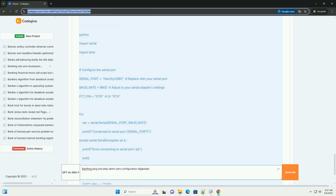8. Configure Direwolf: create or edit the direwolf.conf file, usually located in /home/pi, to configure Direwolf. Here's a basic configuration example. Explanation: MYCALL, replace MYCALL1 with your call sign and SSID, for example W1ABC-10 for a digipeater. The SSID is important to identify the digipeater uniquely. ADEVICE specifies the audio input and output devices. This is where you'll configure the sound cards.